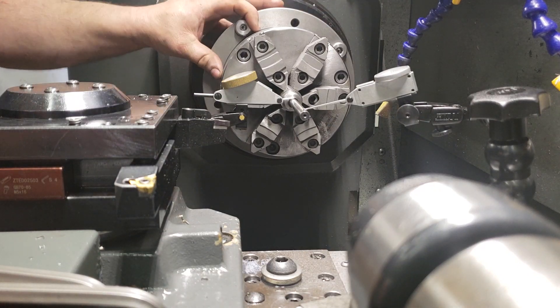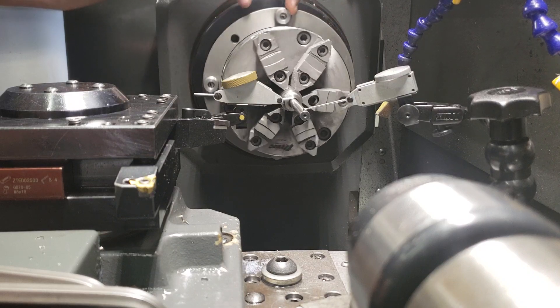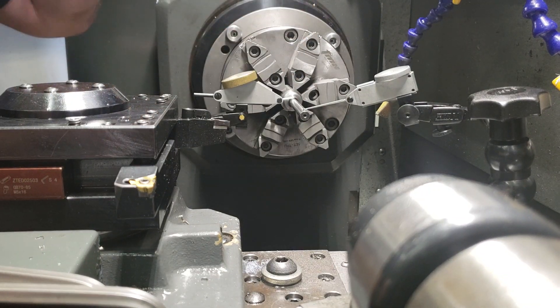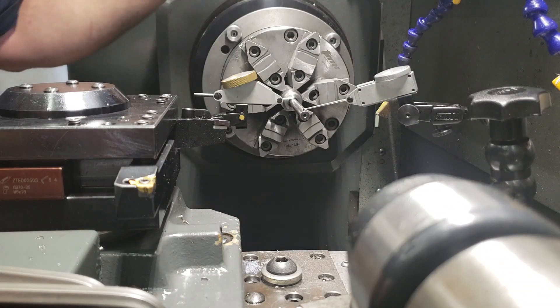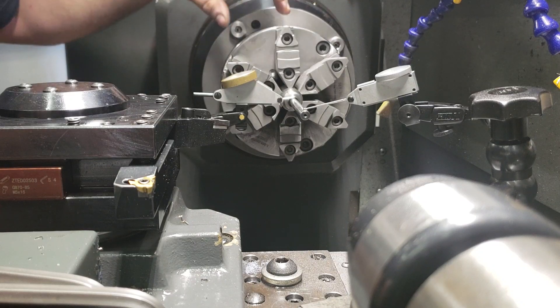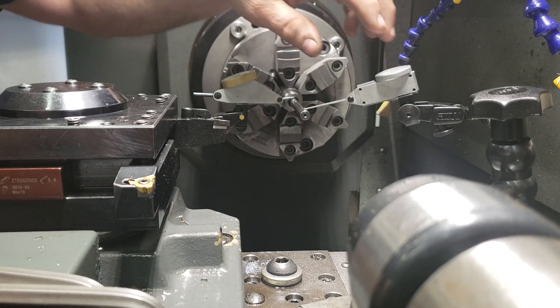This is the true bore chuck, and there's four bolts that go in the face here, and they control the pitch of the barrel. They zero the plane, and then you have four more up along the outside here that act the same as the set-true chuck and control this position.